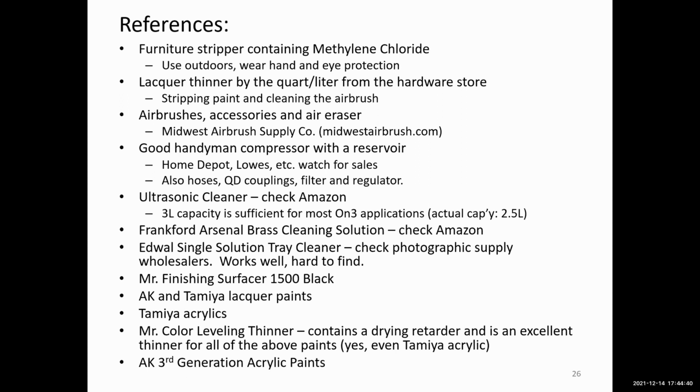Then once the paint has cured, you can go back with a very fine oiler and reestablish all the lubrication at the bearing points, run it a little bit to get the gunk out of it, and then it seems to run fine. Yeah, I imagine it's a good technique not to forget to do that part. Go back and do the lubricating before you put the locomotive on the track and try to test run it. The locomotive will tell you if you forget. Yeah. Mike is asking, what grit of carbide grit do you use?